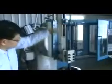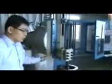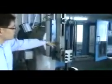The ram running position: the ram can run the stroke at this position or this position according to your workpiece. If your workpiece is very high but slotting here, you must move the ram to slot at the top. So we introduce how to adjust the slotting position. We call it the slotting position.